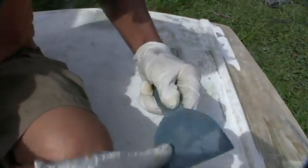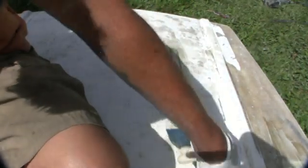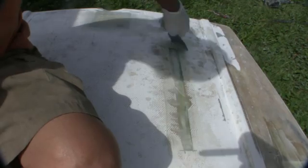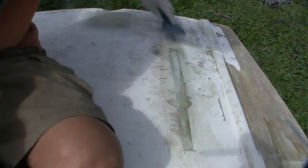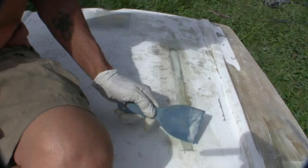We take this putty knife and clean it off with our fingers because we've got these super cool surgeon gloves on - that's what they are really. See, that makes it perfect. Like I said, this 1/16" milled fiber really takes some finesse to get it to build right. I built this section up where it's wider, we got it pretty deep back here, filled in these crack marks from the saw.